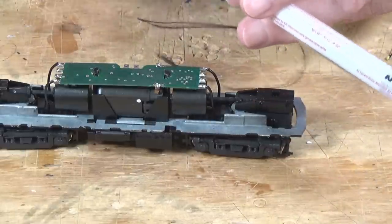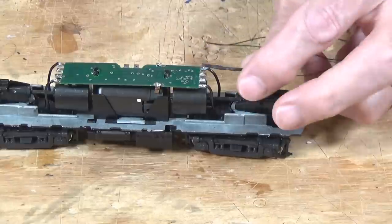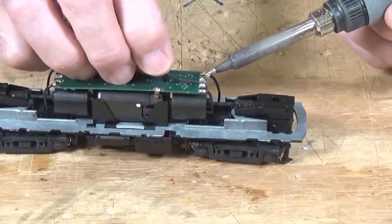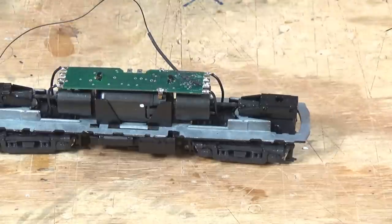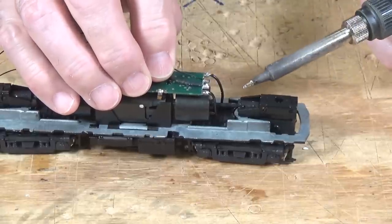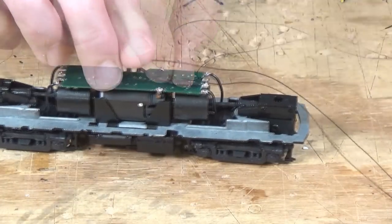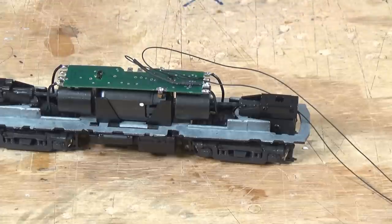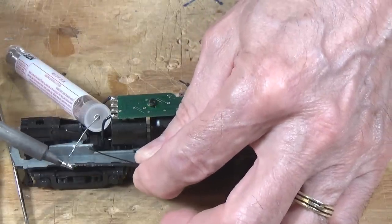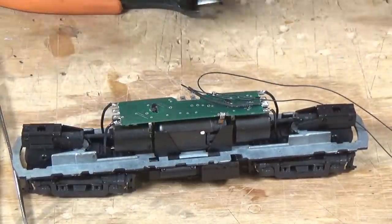You can shorten these wires and move your resistor around if you want, or you can go ahead and use the full length. I prefer to use the full length because I can fold these up and tuck them inside of the shell without any problems — they'll sit up on top of the board and you don't have to worry about shorts. It makes it a lot easier when you're dealing with bulbs connected to headlights in the shell yet attached to the circuit board on the chassis. So I'm going to pre-tin these as well, and get this little LED ready to go.